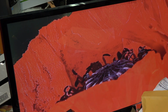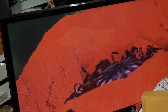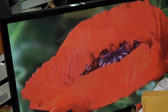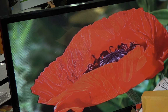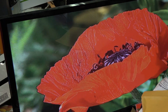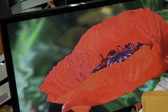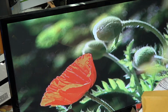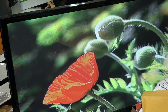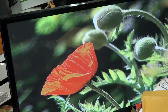The problem is, many times when these heads clog up, they are not clogging up from just dirt. Yes, if the tape is dirty and it's just picking up debris from the air or from a dirty tape, possibly you might get them clean with alcohol and a cleaning stick or paper. But 9 times out of 10, it's not just dust or smoke that's been on a tape or something sticky. Like if someone spilt something on a tape, someone got their fingers on the tape, yes, that will work.